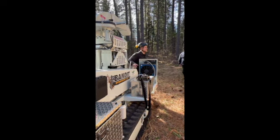To put it on, it's real easy to do. When you get to that point, you'll probably even forget I said this, guys, but essentially just put a groove on the end of the pulley, simply walk it on with your hands. Be extremely cautious, wear gloves when you do that. We've seen guys get their fingers caught in that pulley and belt before. It's never a fun time because your finger's not going to win that battle. So just walk it onto that pulley, nice and easy, and then once it's fully onto those grooves, pull that engine back over, tighten it, and go from there. So great question. Any questions on the belts, guys?